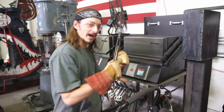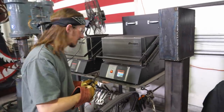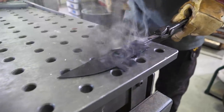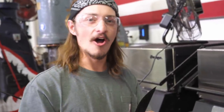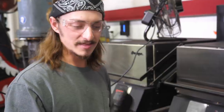We are up to temperature. I've got welding gloves on and the quench tank right here — one smooth movement into the oil. We've got scale popping off the knife, which is always a good sign, and we're pretty straight. The file is not removing any material and it's got that high-pitched skating file noise. We're going to put this blade back in the oven for a temper cycle. After heat treat this blade is hard and super brittle — if I dropped it right now it would shatter like glass — so we'll do two two-hour cycles at 400°F to soften it up a little bit.